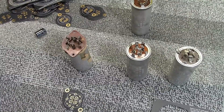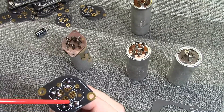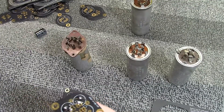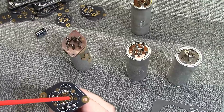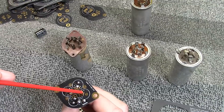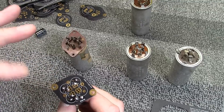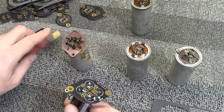I've done a couple and worked up a technique. I found it easier to fill the holes up with solder first, especially if you're working with the chassis on its side, where it can be hard to get solder to flow in well. Also tin your wires first. Then you can just heat up the hole and stick your wire in, hold it in place until the solder cools, and you're good to go.